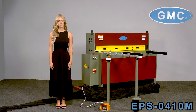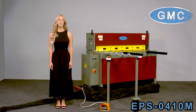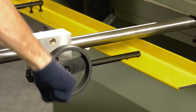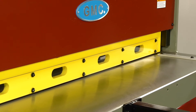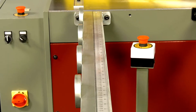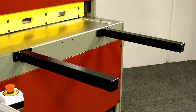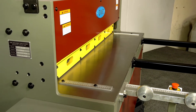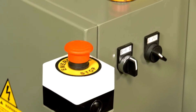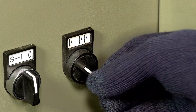Shear features include a 26-inch one-side handwheel operated manual back gauge, a full-length spring-loaded hold-down bar with neoprene inserts to reduce marring, a 60-inch squaring arm with scale, two front support arms, a full-length solid work table, a fast 30-strokes-per-minute cutting rate, e-stops for emergency shut-off that meet OSHA requirements, and auto or inch select ability.